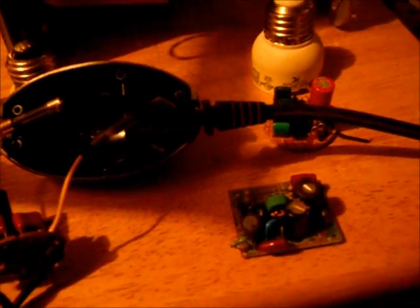So I ordered some new transistors, put them in and still didn't work. But finally I found out the little transformer in there was bad. I have that here as well — a little thing there. I tore it apart to see what was wrong with it and the winding was open. So that whole board was pretty well shot.